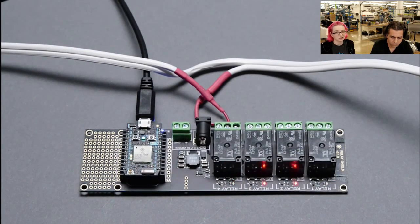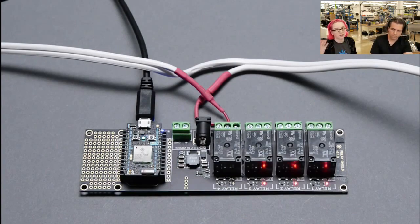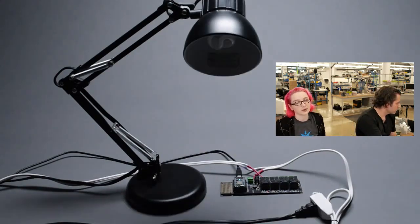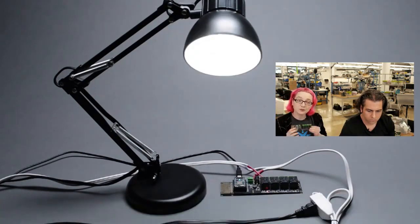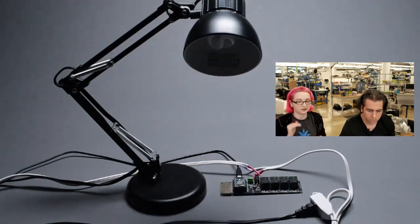I made a cord here by slicing an extension cable in half, so you can plug in the two wires into the normally open and common. There's a little red LED shining off the relay — it looks like the relay is lit up, but it's actually an LED right below it that will let you know when the relay is activated. So if you want to remote-control mains-powered stuff, or even just have isolation for something you're controlling — for example, here's a lamp, you plug into the extension cord, you can turn the lamp on and off. You can control appliances, power tools, or anything that plugs into the wall, really, and you can do it over the Internet using the Particle Cloud. We don't carry a lot of relay products on purpose, so be careful — use a lot of caution. Very easy to accidentally brush your hand against it and get a jolt.